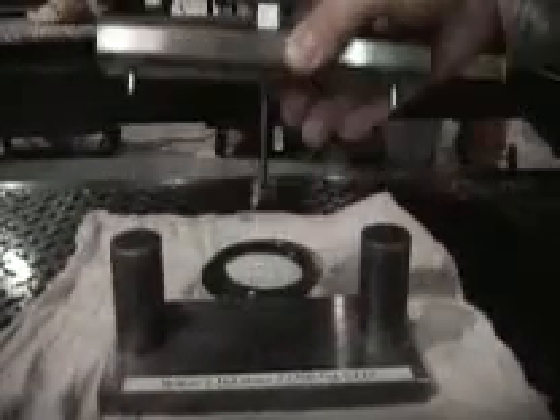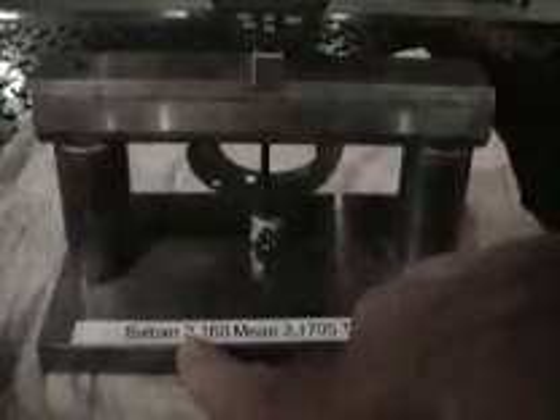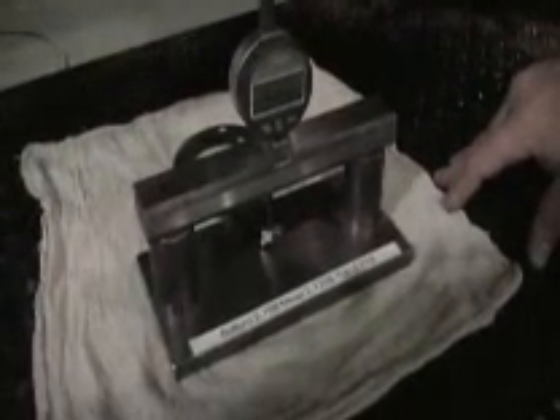We'll move to a picture of the tool while the tool is on the rest. As you can see, the tool is designed in two parts: the rest and then the gauge itself. You can tell by the design of the pegs — these are ground to the right height to determine your measurement from the hub nut to the hub face. These are ground to the mean of the measurement that is required in the IETM after step 21.